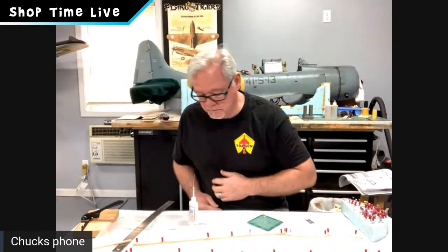It actually soaks in balsa to balsa, like we talked about in our early episodes. It just wicks into each other. Yeah, you won't even know that that split was ever there. The cool part about the way the CA works is with the thin, if you do that, it's actually going to be stronger there than it was before you put that split in.